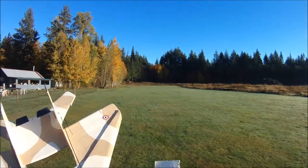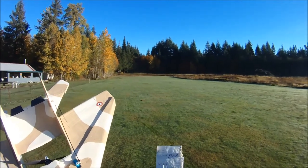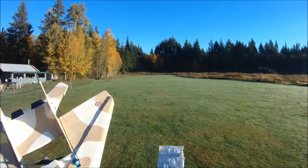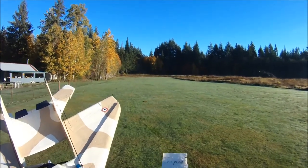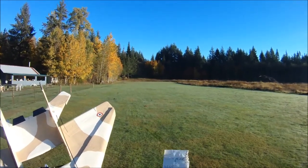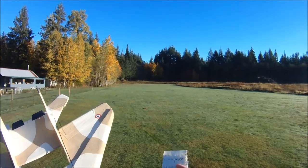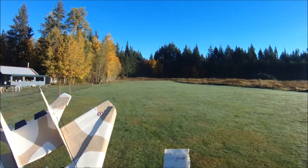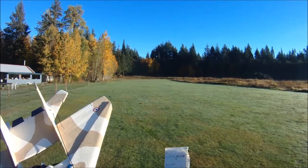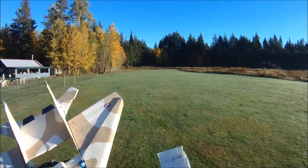The funny thing is, with the two quad racing motors I've tested, the bench numbers for the 6x4 EPC — which I ran in the last video — really don't show very well, but then I get out to the field and it flies really well. With the 6x4 EPC, it's pulling more amps at half throttle — 14.8 amps — but only generating 13.2 ounces of thrust. Full throttle, 34.7, almost 35 amps — a 25% jump in amp draw — but on the bench it was showing only 21.3 ounces of thrust, though in the air I think it was performing much better.